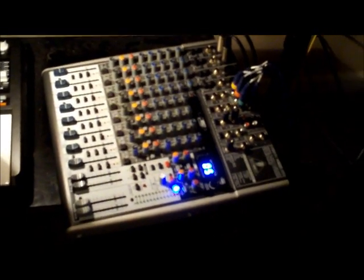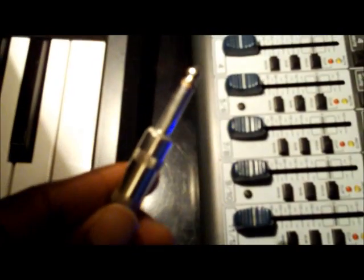My good tip for you is, if you get a mixer like that, this Driverack only takes XLRs. If you're going to be dealing with a PA mixer like I just showed you, I advise you to get an XLR that will plug into this, and then the other end of the cable, let me turn this off, have it look like this. That way you can hook up, say, a stereo channel: subwoofer left, subwoofer right, main left, main right, like I showed you with the little button thingy. It would keep you from accidentally hooking up to these, because they're only designed for microphones.